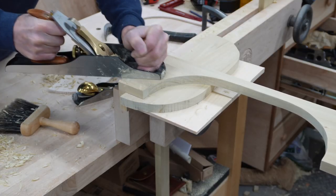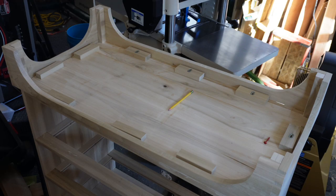Here I'm just taking some time to clean up the base. Since this is a natural wood project using poplar we have to be concerned with wood movement. The carcass is going to move and for all intents and purposes the base is not, so we have to allow for that movement when connecting the base to the carcass. The three glue blocks in the front and the one on each side will be glued to the bottom of the carcass and the inside front of the base. The remaining glue blocks will only be glued to the inside base and only screwed to the bottom of the carcass — no glue. Each of those glue blocks has an elongated washer, and the wood below mirrors that opening, so that when the bottom of the carcass moves toward the back, the screw and glue block configuration will allow it to move without splitting.